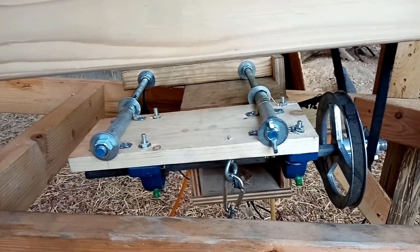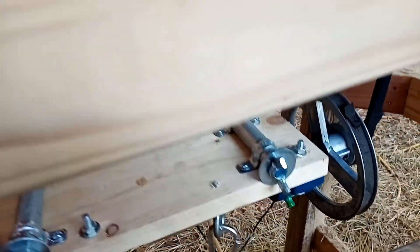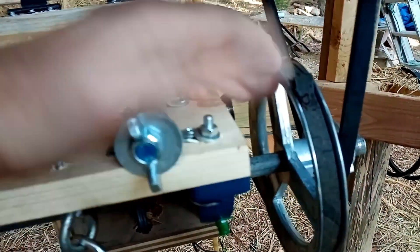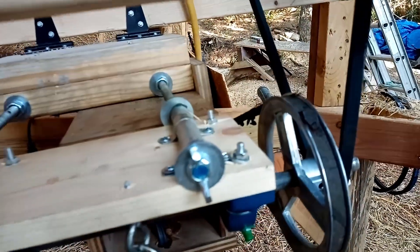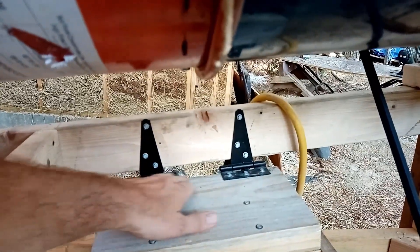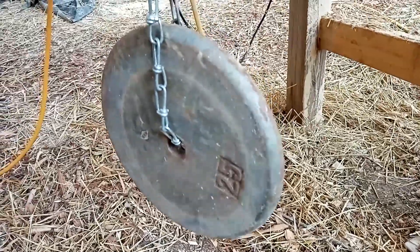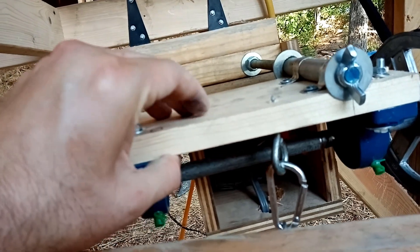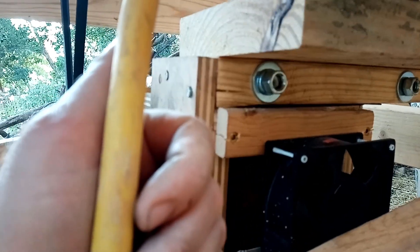There's my drive system — it's kind of flipped upside down from the drawing, but it's good to have these tensioners accessible on top because you're probably changing this belt out fairly often. You can see how it's starting to wear, so I'll probably change this one out pretty soon. You can see it's mounted on two hinges, and tension on this belt is created by a 25-pound weight that we have bolted onto the platform. I've got a little muffin fan on the back because sometimes the motor will overheat, so it just keeps it cool. There's some UF cable running to our weatherproof switch box, which is good because it's covered with mud.